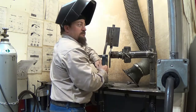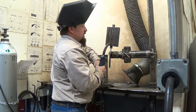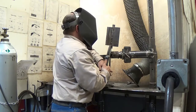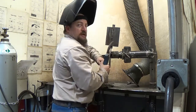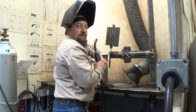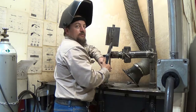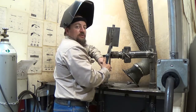So always make a dry run even with your hood down. If you don't have an auto-dark it's a little more difficult. And if you find you have to get a lot closer to the weld to see it, perhaps we should look into getting a magnifier lens to put in there so you don't have to get your head quite as close to the weld pool. It's always a good idea to keep your head out of the smoke too.